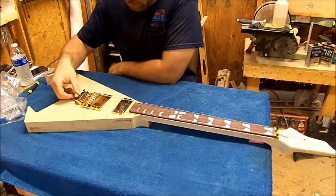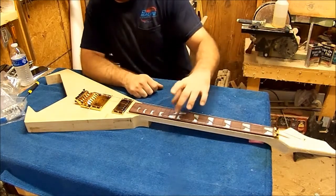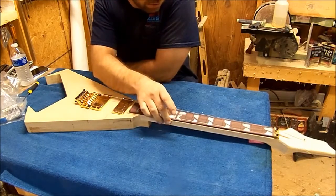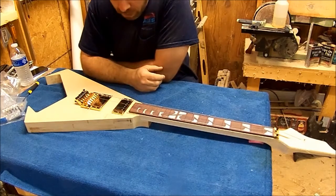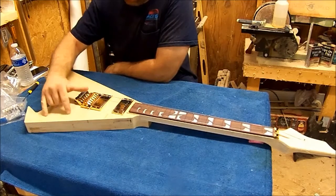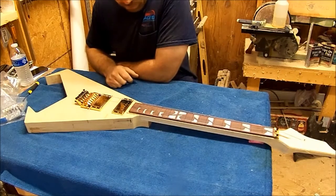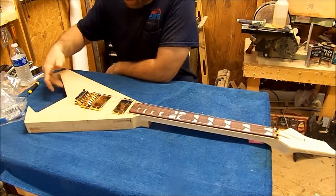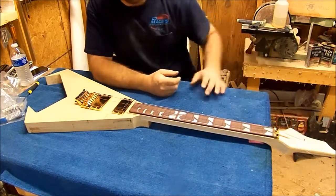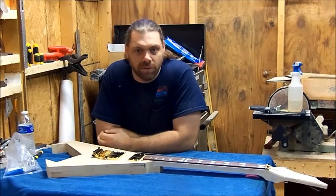Here we got it — we got the neck on it, the bridge is on, got the two pickups installed, locking nut's on. The fretboard's not glued on yet — it's just sitting on there right now. I'm waiting on some binding; I ran out so I had to order some more, which should be here within the next couple days so I'll be able to glue that on. The pickups are in, the bridge is on — that's the major part. We're going to work on the control cavity next, and recessing this bridge, and the body should be about done at that point. We still got the neck to finish up — shape it and drill some tuner holes. Alright, that's going to about do it for tonight. Thanks for watching and I'll see you in another video.